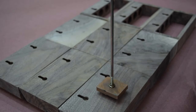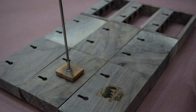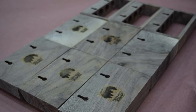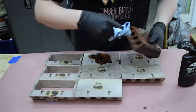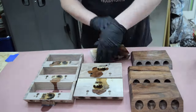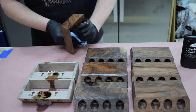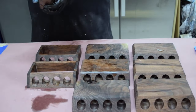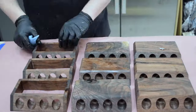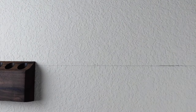The last thing to do was to add my mark. I finished these pieces with penetrating oil, which really lets the grain pattern shine and protects the wood from fading in the sun. To mount the pieces, I used a template with two screws glued into two keyholes, then screwed some anchors into the wall.